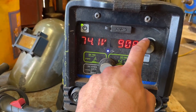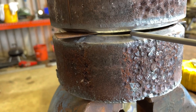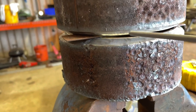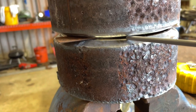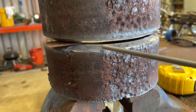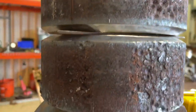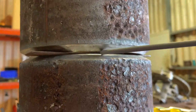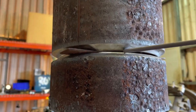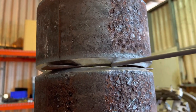We're gonna run it at about 88 amps and go from there. Now remember, when you strike an arc, if your keyhole — which is at the leading edge of your puddle — is getting way too big, you probably need to turn your amperage down. If your 6010 is trying to stick and not penetrating enough, and you see the fire pushing back towards you, you need to turn your amperage up. You want a perfect keyhole so you're able to drag at a certain rate. Every machine is different, and the rods matter too. They also have a regular 6010 — the red ones — those are more explosive, throw out more sparks, and the arc is a little more aggressive, so you'd run those a little colder with less dig.